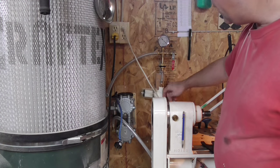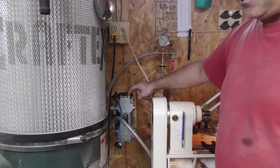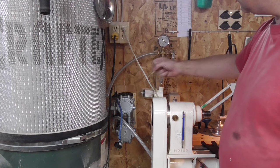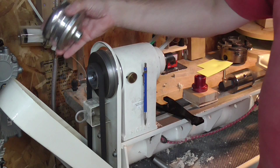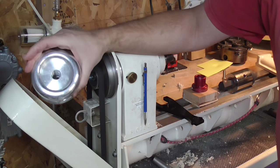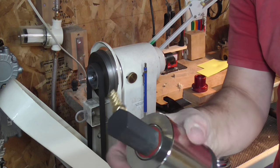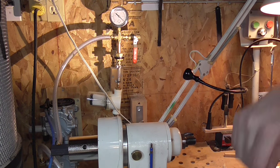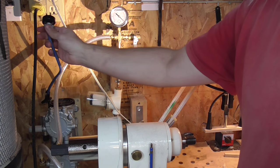I have this air filter — very important because the pump has no filters — and the gauge. The maximum negative pressure is 29 inches of mercury. My one-way 1224 lathe has a removable headstock wheel, so I bought the one-way adapters and I'll chuck it to the lathe. You can see the gauge here: 29–30 inches of vacuum.